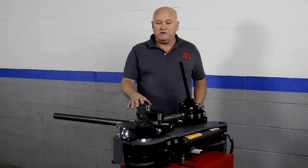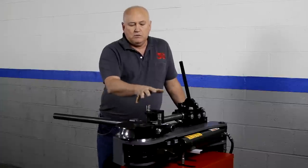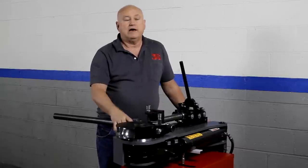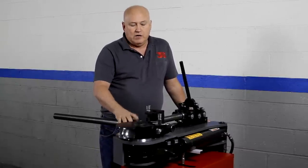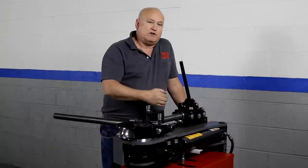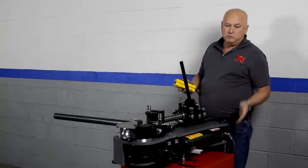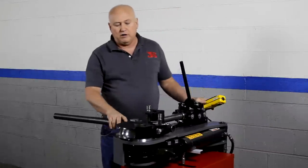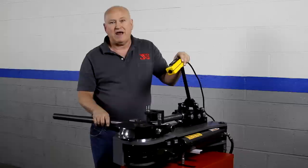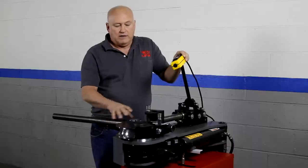Now we set the actual degrees of bend on the computer. For this demo we're bending at 180 degrees — a two-shot bend. The bender will shoot a one-shot 90 and actually bend up to 115 degrees, but for 180 you need the two-shot process. We have a spindle lock mechanism for that. One quick tip: you can spray a little Pam cooking oil on the outside of your die — it works great and doesn't interfere with painting operations later since it's not silicone-based.